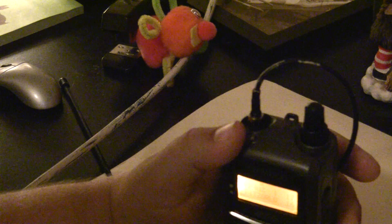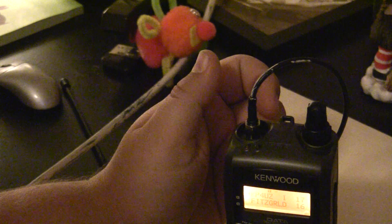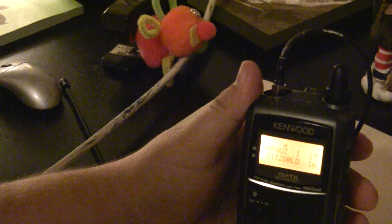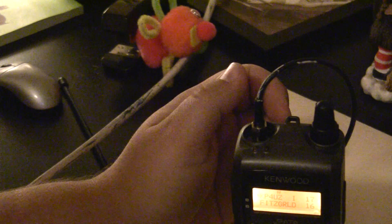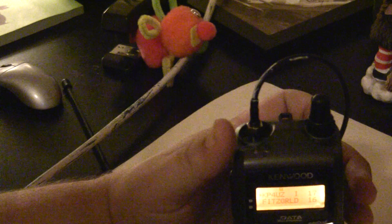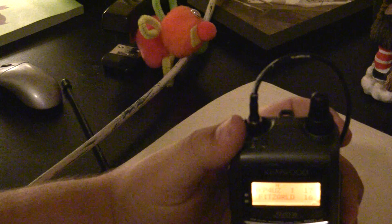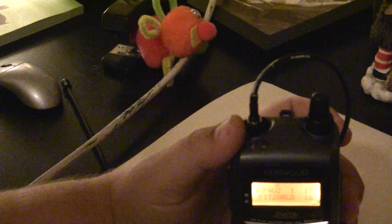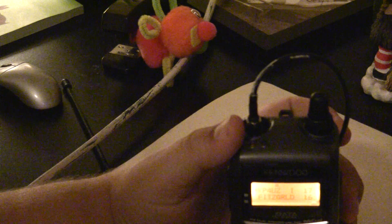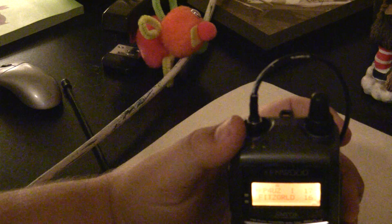Just make sure to call out with your call sign and let everybody know you're going to be using tones. This works the same way with a mobile radio — just push talk and press the tones. On ICOM radios, you may need to press the DTMF button first; it depends on the radio. There are also speed dial memories available for these tones. To summarize: 73 is the disconnect tone, then enter your four-digit node code to connect, and 73 again to disconnect. Not all repeaters with IRLP may be available if they require special access tones. Any questions, feel free to drop them in the comments.